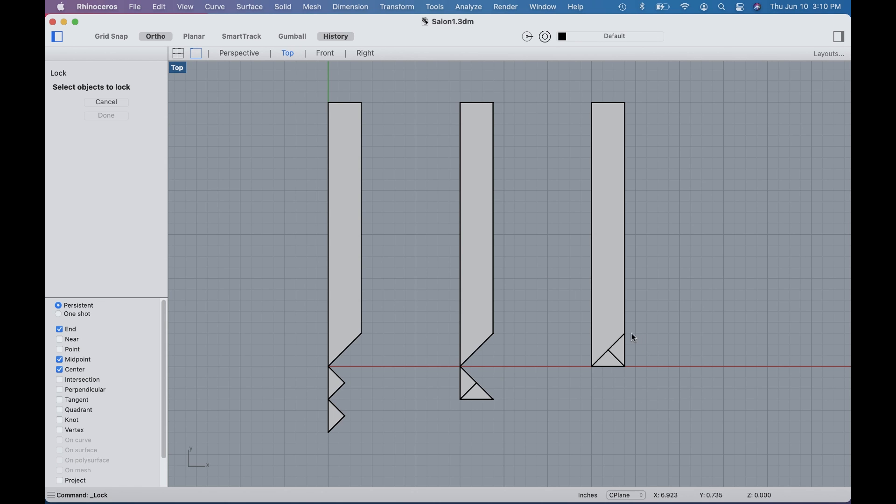Sometimes you may have a problem right in here when it all goes together — there may be visible light. In some instances it doesn't matter, if it's the underside of a shelf or the inside of a cabinet. You can also use a trick from the furniture industry: if two surfaces don't line up perfectly, cut a tiny little groove there called a furniture groove — just enough space that you can't really see they don't line up perfect.